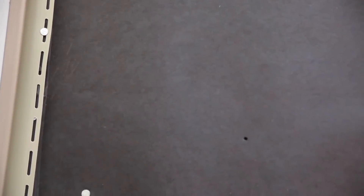Proceed with the trims. Cut the J-channel to the length required. Make sure to install J-channels around windows and doors as well, nailing in at the center of the slot.